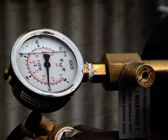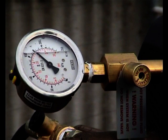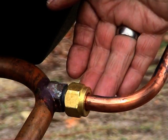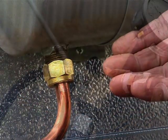Pressurise the system until the PR200 valve opens or until a pressure of 170 kPa is read on the pressure gauge, whichever occurs first. Ensure that the closed circuit pressure remains stable for at least 10 minutes. If the closed circuit pressure does not remain stable for 10 minutes, check all connections for any evidence of leakage.